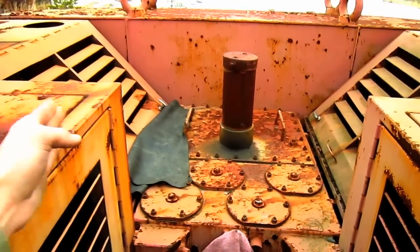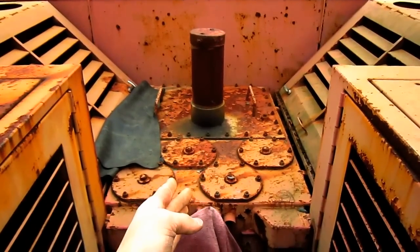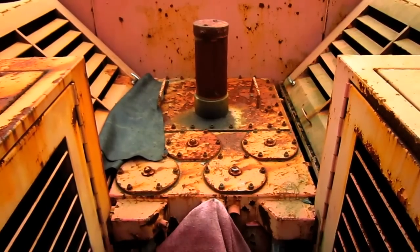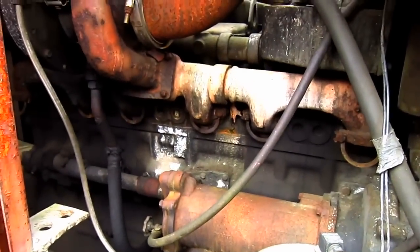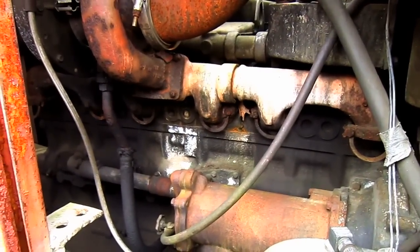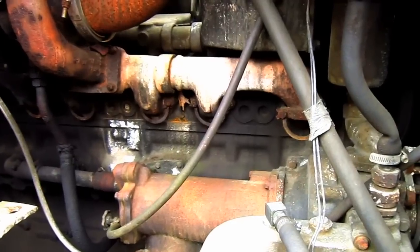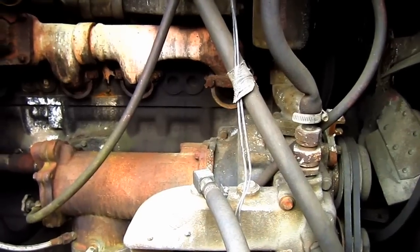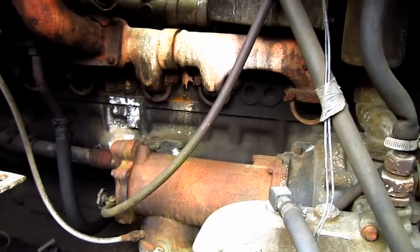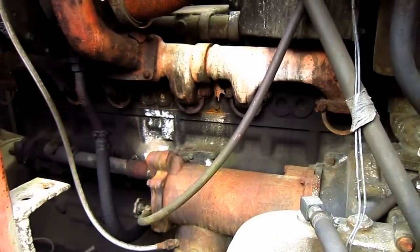On the back of this machine, mounted in between the two engine houses, sits a 605-gallon hydraulic oil reservoir tank, which you can see right here. The RH-75 is powered by twin Cummins NTA 855C inline six-cylinder diesel engines, each developing 357 horsepower, to produce a total combined output of 714 horsepower. This replaced the twin Deutz engines utilized in the older RH-60.